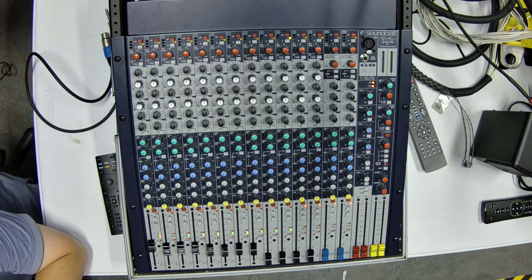That's why the cable checker is wired in that way, where you have the button and the light. If a different light comes on than the button you pushed, that's how you know you got a wire cross somehow. But that cable will still work. It'll just be out of polarity. And you might go years without knowing that or that ever being a problem for you, until you're in a scenario where you're using that cable connected to a microphone, and a second cable connected to a different microphone, and both microphones are pointed at the same thing. Then you mix those two sounds together, and now those two mics are opposing each other and creating cancellations.